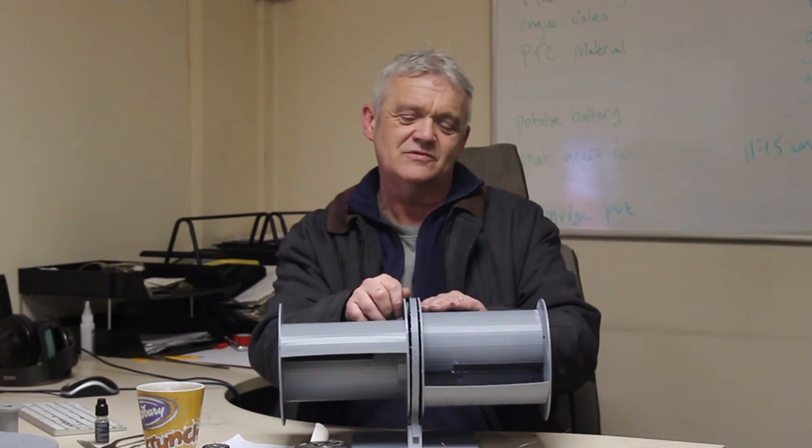When we were running this, it was shaking worse than a drunk clown on a high wire. But balancing aside, we actually got a pretty good result out of that, and contra-rotation is certainly easy to set up. I'm absolutely fascinated by that washing machine with contra-rotation. The real problem with it was that he was using two motors, and you have to time those motors — you double the expense. It was basically two washing machines bummed back to back. I think with generation at the rim and driving at the rim, we ought to be able to make that much less complex. Contra-rotating washing machine — it uses so much less power and water. But in terms of generation, contra-rotation certainly seems to be a way to go.